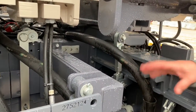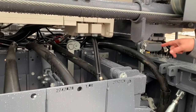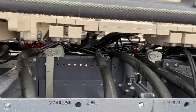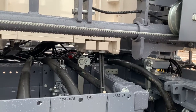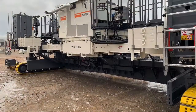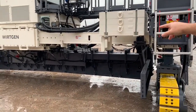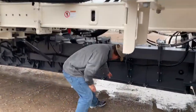We use immersion vibrators, same as the competition. We have a grout box auger and a tamper bar inside. You can use this machine on 90% of your mix designs without either of those two features, but on really coarse, large aggregate mixes it helps to have the tamper bar. The grout box auger gives concrete a little wake-up while you're paving, but with plow control to push concrete left or right, that auger doesn't always come into play.